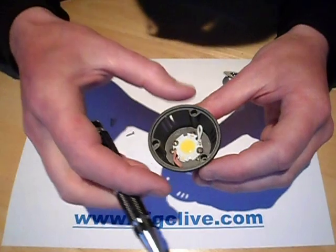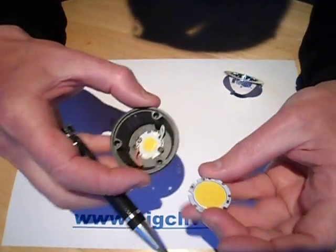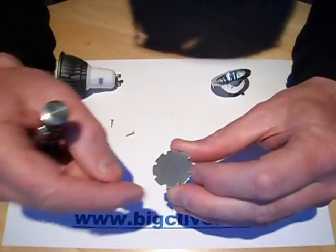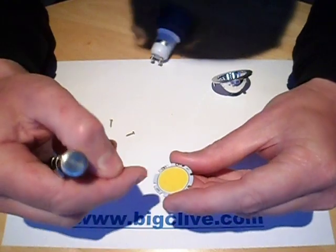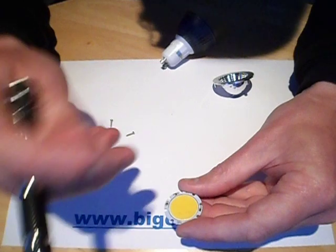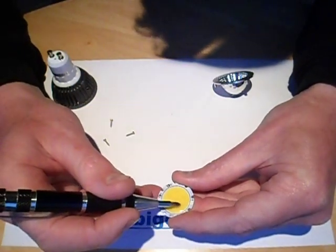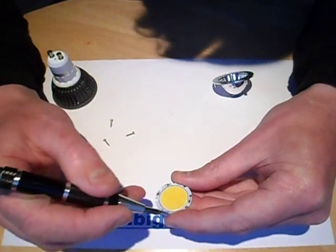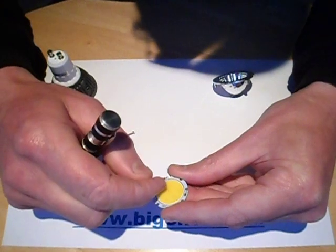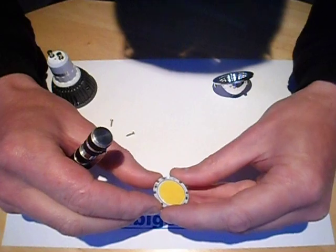It's actually chip-on-board. This seems to be something Chinese manufacturers are doing quite a lot these days. Here's a bigger COB — instead of getting the aluminium substrate circuit board and then mounting existing packaged LEDs in it like the Luxeon star 1-watt chips, what they're doing is putting surface-mount chips directly onto the substrate, putting a little dam around them, and then flooding it with an almost rubbery silicone-feeling stuff with phosphor embedded in it.